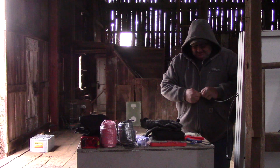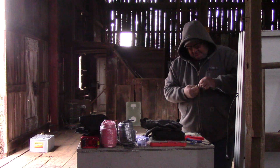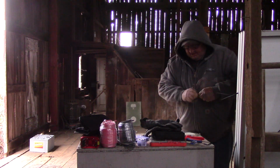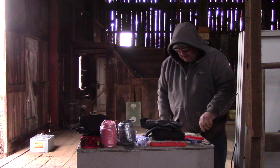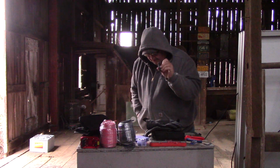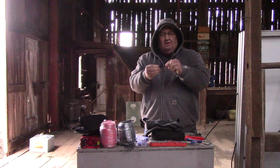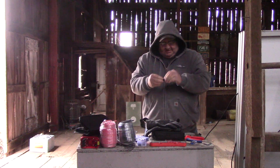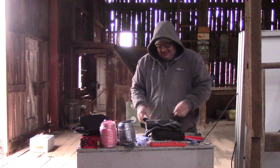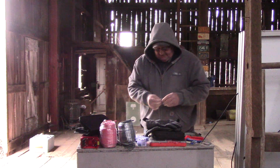And I had a subscriber tell me, not that I was doing these wrong before, but a different way to do it. And I'm going to try that because I believe he was right. There we go. These are the positive MC4s. These are the negatives. What I was doing was taking all this apart with the rubber seal and everything inside it, sliding the various pieces onto this wire, and then tightening it all back down. And he said these are designed to just put the end on the wire and shove it all through here and then tighten it down, which does make sense. So I'm going to try that.